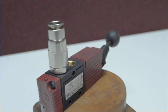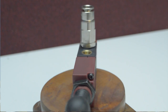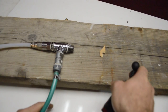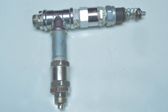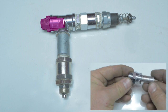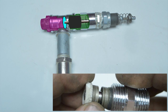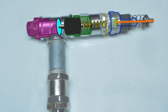To activate the QEV valve we need a valve to let the air go out from behind. Every time that the air goes out from behind, it activates the QEV, shooting all the air out very, very fast. I represent in purple these two pieces: this simple connector with inside a small tube behind it. There is a male-to-male connector and inside this connector there is a small piston pushed on the front with a spring.